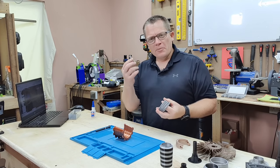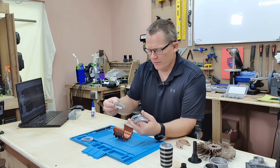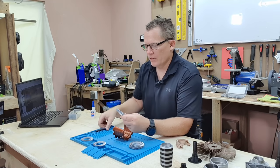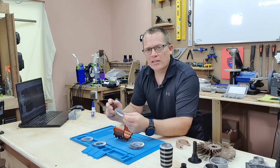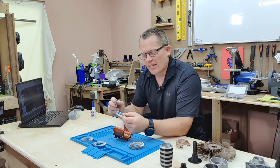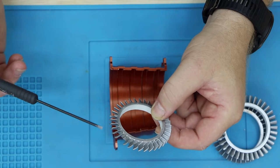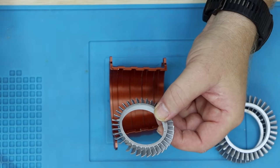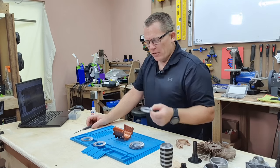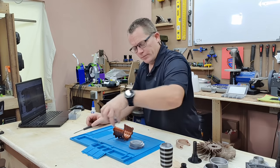Because this was my first resin print of this design, I made a few errors. And hopefully you can see, yes, that's probably a better choice. Now, when I selected support on my slicing program, I added supports to every single fan blade, and that just wasn't required. Hence, there were too many supports, and when I broke them off, I broke a couple of blades. For the time being, that will do. We can always come back and reprint these better at a later point.